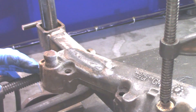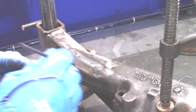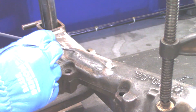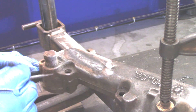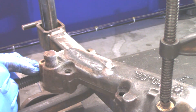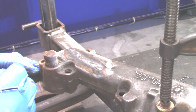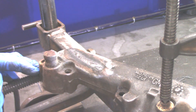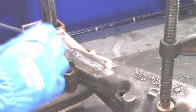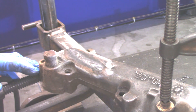Really happy with the way this turned out. Got a little bit of slag there that doesn't seem to want to come off, but as you can see, that filled that crater really nicely. We're going to apply some more preheat so this cast iron cools down more slowly — you're supposed to cool it down slowly when you weld on it. Got a real good feel out of that, the weld looks nice, I don't see any porosity. Looks really good — done a great job.